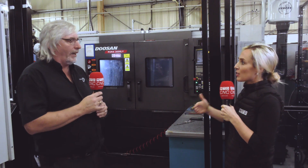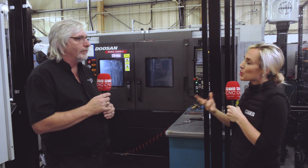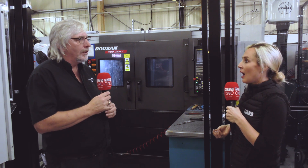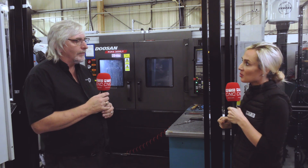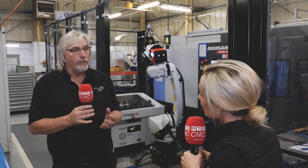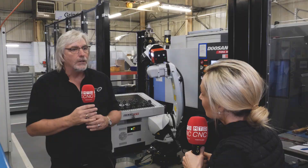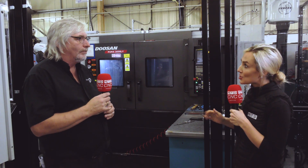It's like you're in training for a marathon — once you start you're just going to keep going. What would you recommend to anybody watching who is a subcontract machine shop thinking they need one of these? The hurdles are: you've got to define what you want to do with it, which machine you want to put it on, understand how you're going to run it, what tooling you'll use, the floor space, the safety issues. Make sure you've got a complete picture of what you're trying to achieve. And any regrets at all? Not yet.